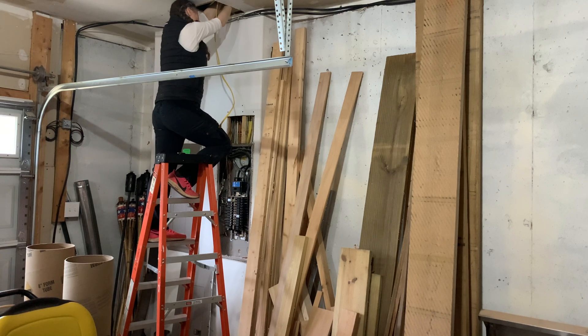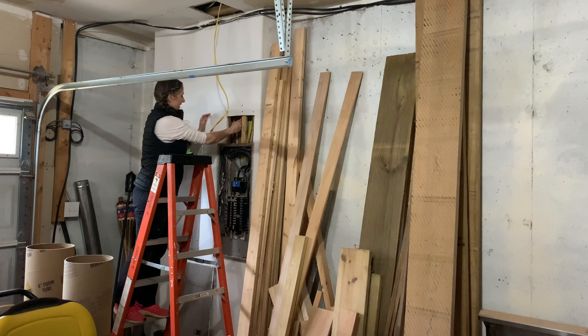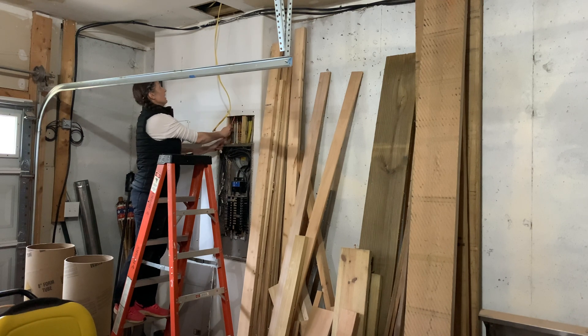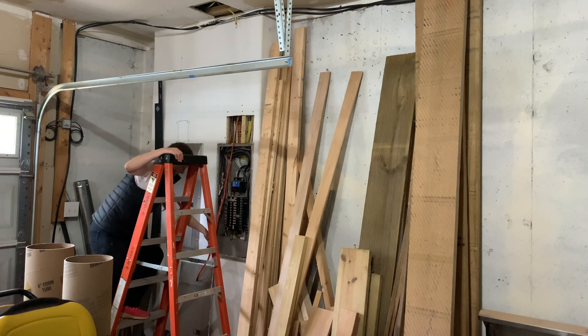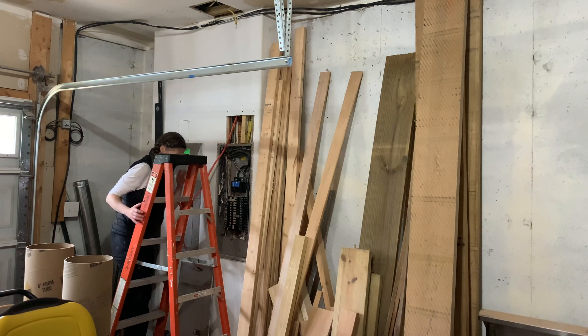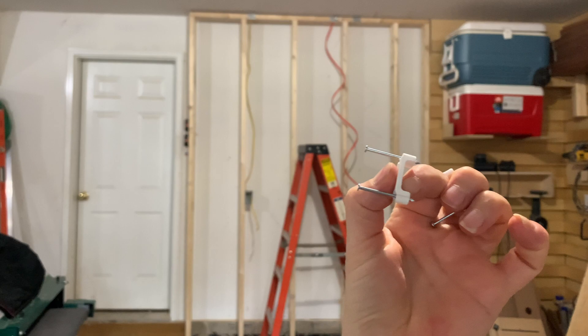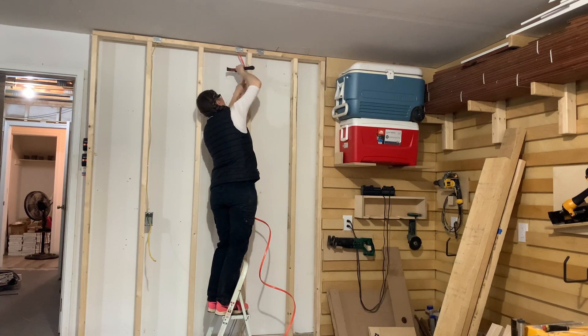It's a little bit tricky through this section — there's a lot of studs. But it's not a very far distance, so pulling the wire directly is a piece of cake. I pulled an excess amount of wire down and gave myself a good bit of distance so that I could come back to it when I go to install the breaker later. I like to work with a dead wire, so I don't install the breaker until very last. I'll secure the wire using these NM cable staples. They come in different sizes, so you want to make sure you get the right size depending on your application.